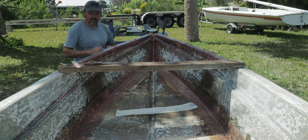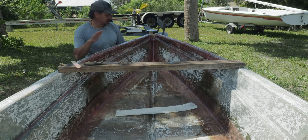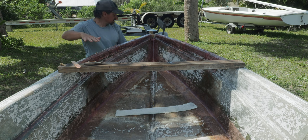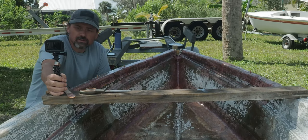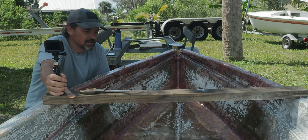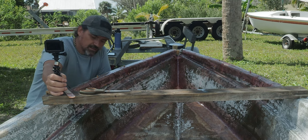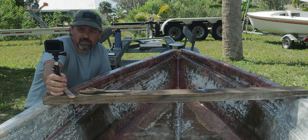I got the last layer of glass thrown on for my tape seams. I'm going to wait and let this set up, then come back and sand-taper all my edges. The whole boat's going to get a layer of 1708 after this, and then I can start working on my interior layout, which is going to be super fun. This is probably a good spot to end this video. Thank you for following along — if you haven't done so, go ahead and subscribe and continue to follow along on this build. Until next time, take care and hopefully I'll see you out on the water sooner than later as this boat's starting to come together.